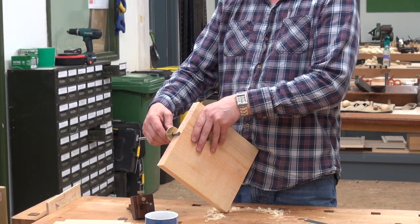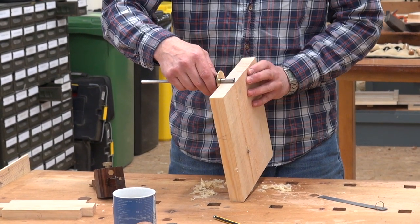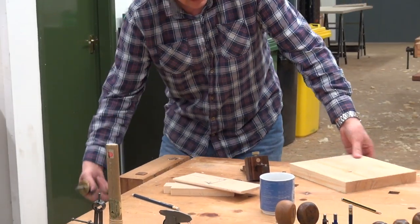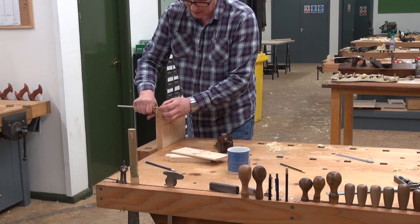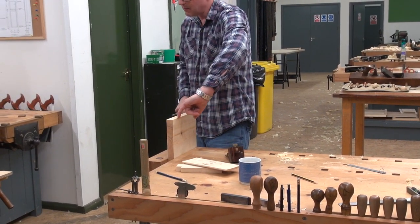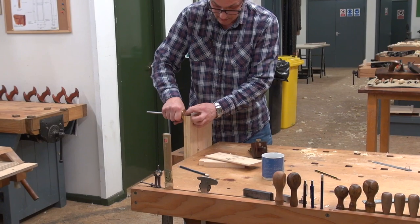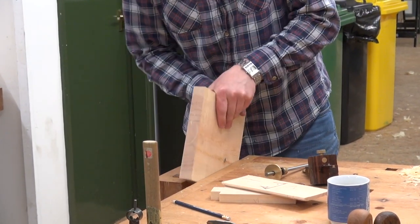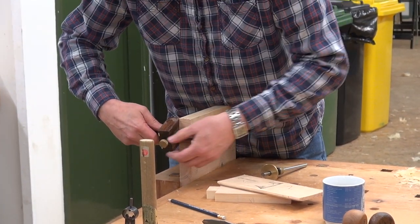I'm working my way around, not putting any marks on, just making sure I actually did get the low point — and it looks like I have. Drop it in the vice — a vice is an extra pair of hands — carefully keeping the gauge nice and tight to that edge, and put a nice clear mark. Take that all the way around. This is what we're going to plane down to in a minute. That's the easy mark — now I'll show you how to use the harder one.